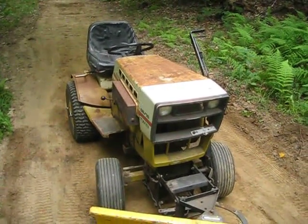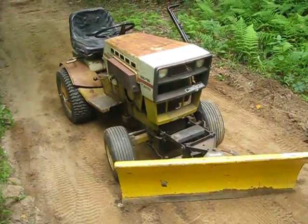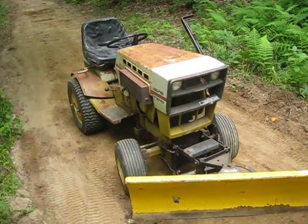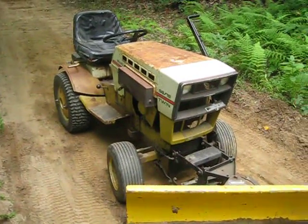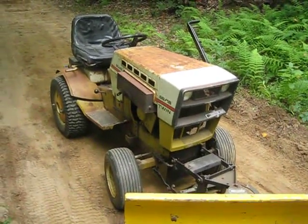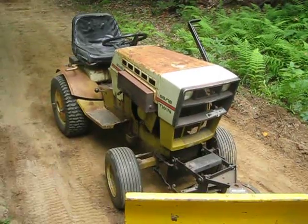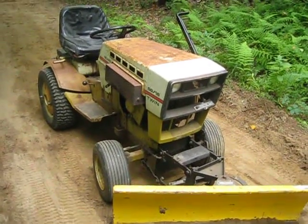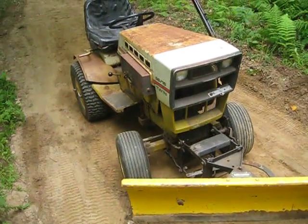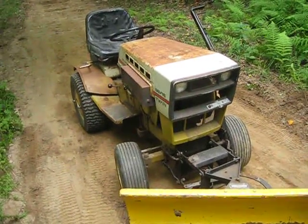So what I'll do is, the pull for 4-H is on Saturday, and I need to take this tractor there on Wednesday. So I really only have today, Monday, and Tuesday to work on it. And so I think what I'll do is tomorrow I'll take the air filter off, go through the carb again carefully so I don't tear this float. Clean the idle screws, adjust it perfectly, put a fuel filter in, whole nine yards. So there's a little bit of work that needs to be done on it, but I think it's coming along pretty nicely. So let me know what you think.